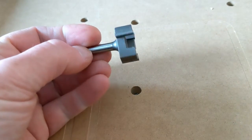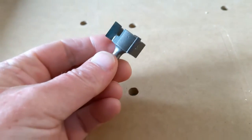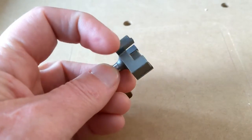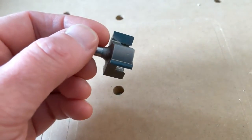The tool I'm using to resurface this bed is a 1 1/8 inch router bit. I got this particular one because it's carbide — they all should be carbide-tipped. You can see there's a little step there where this tip has been welded onto the body. It's also got a nice square profile so I can use it for side milling as well.